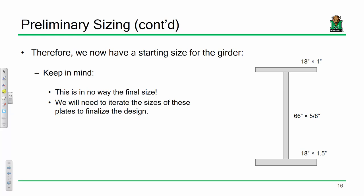Now, these are assuming very typical loading scenarios. So for bridges like this, we're talking about 8-inch concrete decks, typical AASHTO HL93 live loads, typical stuff. Now, let's be clear. If this was a transportation stop and the trucks were heavier, well, this wouldn't work, you know. So this is just fundamental loads, basics.